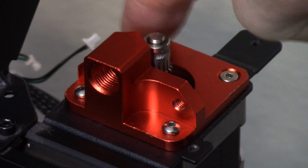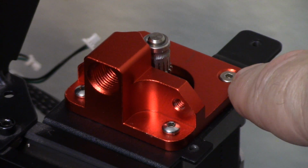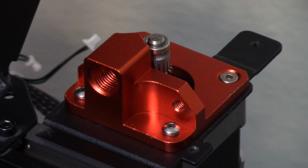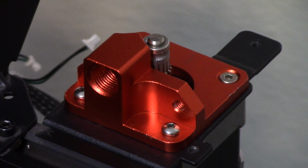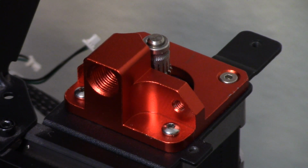Leave this corner screw out. In my application, this corner screw, the countersunk screw, was too long. You're either going to have to find a shorter one or replace it with something different. There really is no way to properly space a countersunk screw. So in my case, it just made a trip out to the belt sander and became about 3 millimeters shorter, because that blind hole only has about 3-4 threads before it hits the bottom. Can't really blame the manufacturer for that. That hole in that stepper probably could have been deeper. But anyway, that was it.